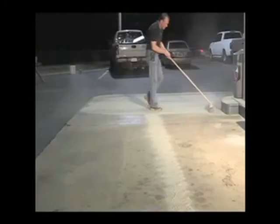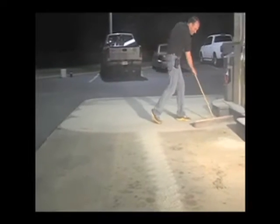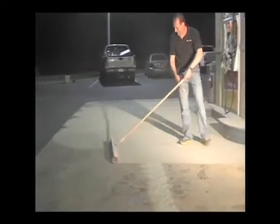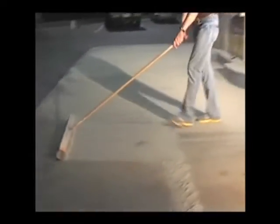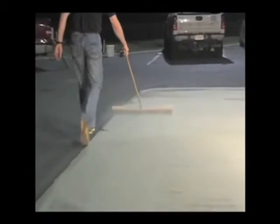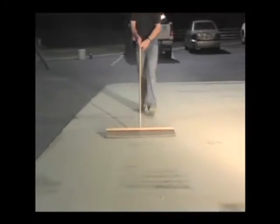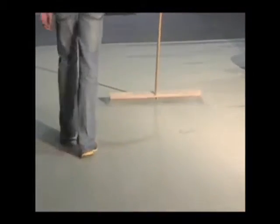The objective is to use the applicator broom to push the material over the concrete surface, using the most square footage the broom can cover. Long smooth strokes is a key to doing this application well and in a timely manner — first side to side, then up and down the length of the concrete pad. Two directions is a minimum, and a third may be necessary in order to get the material to cover the surface adequately. Just push the broom — don't force it, don't push down on it. Just push the broom over the surface and let it do the work.